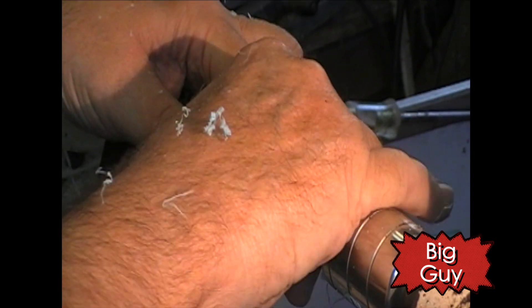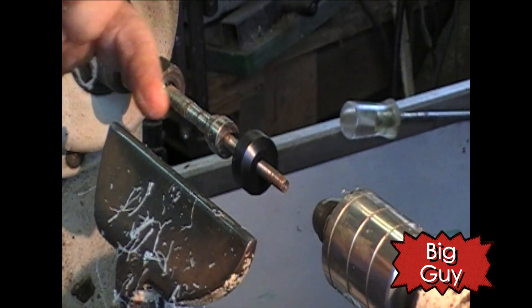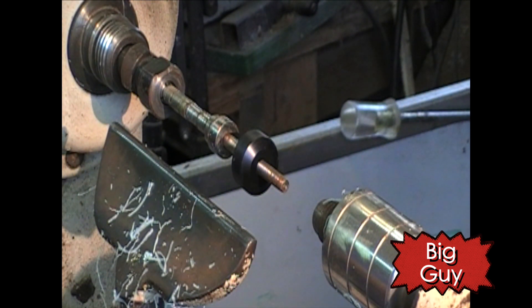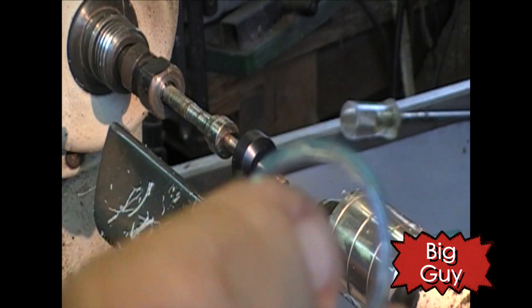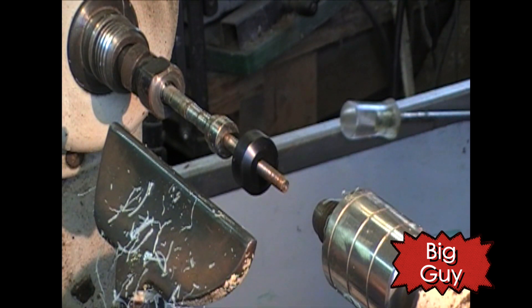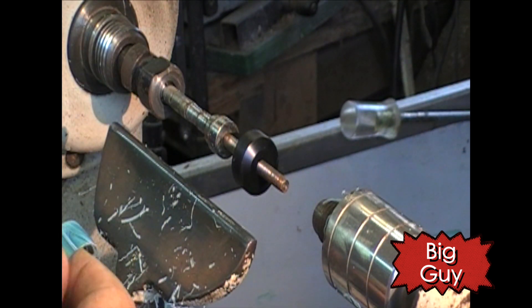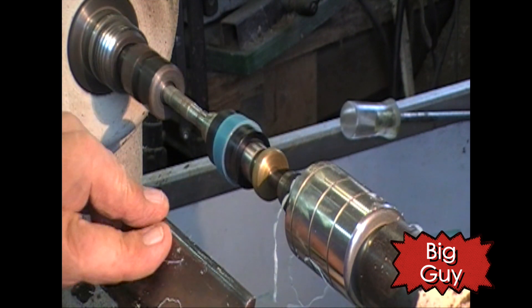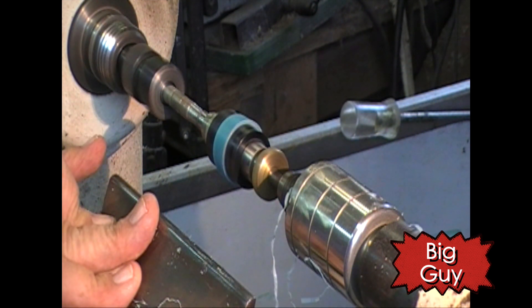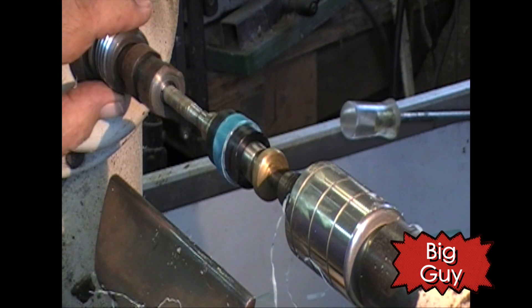What I want to do right now is take a look at how the piece is shaping up. I took my Delrin ring off and I am down to where — that's thin, folks, that's really thin — and that might be where I want it to be. I can see the stainless through it. So I'm going to true up the two edges, then put it in and polish it out. I've dressed it off and I'll bring the speed way down — it's beautiful having a rheostat that works right. Bring it up a little bit.